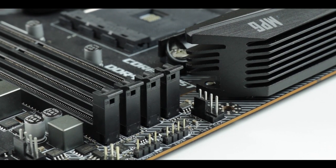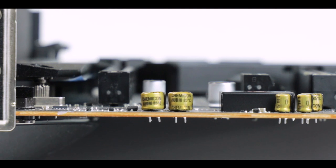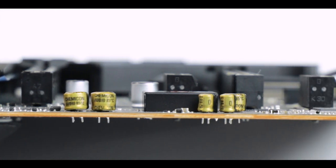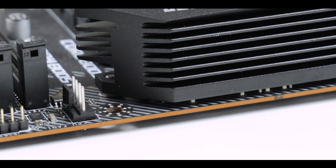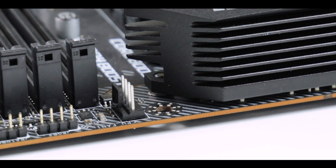More layers also help a lot by radiating away the heat produced by our VRM. Having only four layers is the bare minimum. It works for something like the Aorus Elite, which actually has copper plates in between those four layers — but we don't have that with the MSI X570 Gaming Edge, and I'm a little bit worried about the overall stability of this motherboard, especially long term.